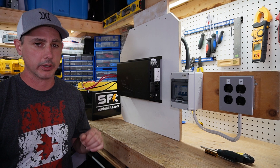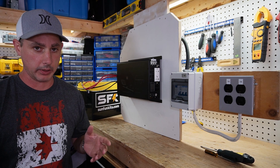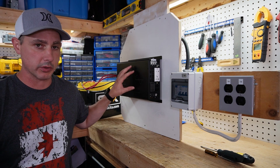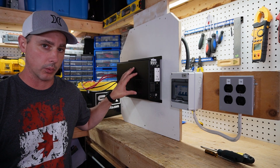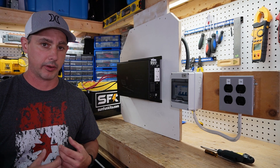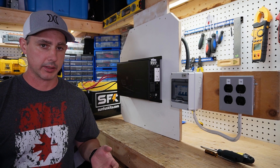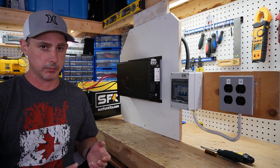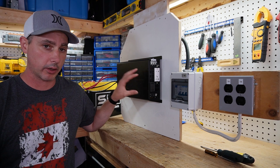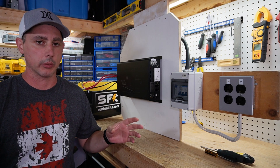I'm going to be using three 100 amp hour batteries, which should give me 300 amps of power — and 250 amps is what you need for running 3000 watts. Something about inverter sizing I need to mention: I've fallen victim to this over the years. You buy an inverter, think it's going to be enough, then you want to add more things to your system and need to upgrade again. Buying a larger unit right off the bat is more beneficial than starting small and working your way up.